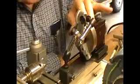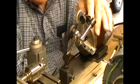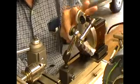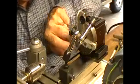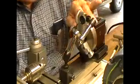I'm about to turn the small cranks and I want to be absolutely certain that all three are absolutely identical so that they can line up and run concentrically. This is lead bearing cold roll steel which is very good for machining. I've set up a test indicator here and it shows me that I'm getting less than half a thou runout, so I can be pretty sure that when I drill it's going to run concentric with the outside. That's the way to check.